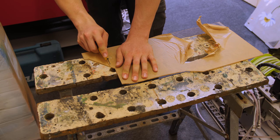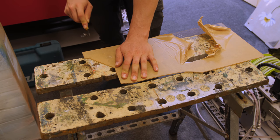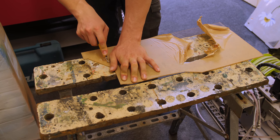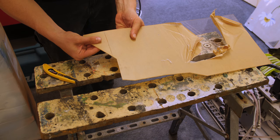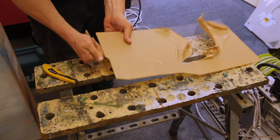Our third tool is this really cheap plastic cutting knife right here. You can buy these from hobby shops or search online — it's called a plastic cutter. What this does is serve two purposes. You can cut the plastic by scoring down, which weakens the point when you bend it, creating a nice straight cut. All you have to do is score down the acrylic to about halfway and that weakened point will just snap, giving you a nice clean cut.